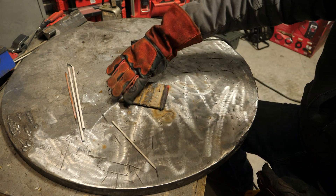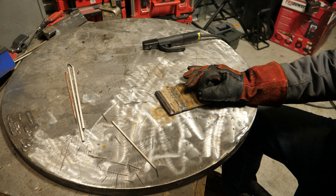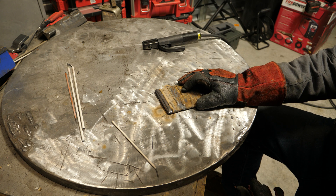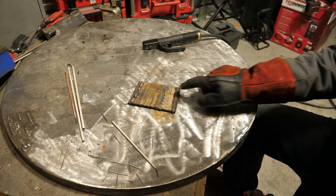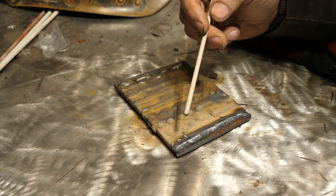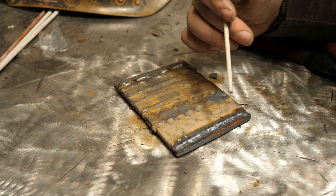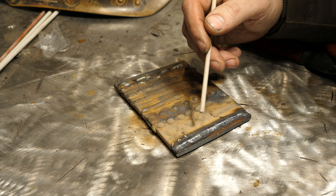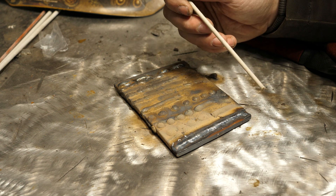That's what I'm talking about! That is a smooth arc. It's been a long time since I've run on a Dial Arc 250 — I've almost always run the big machines, the Ideal Arc 250 or a Lincoln Precision TIG 275/375. Man, that's a sweet running machine. I put it a bit over 95 amps and the output had I left it at 90 would have been dead on — that's just the nature of these welders, they're plus or minus 5 to 10 amps on a set point. The Ideal Arc 250 and Lincolns are even worse because you're really guessing the set point.